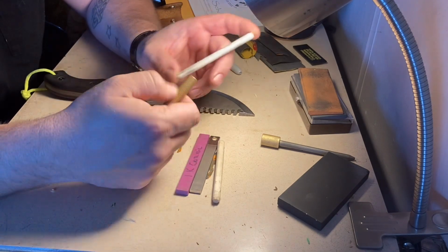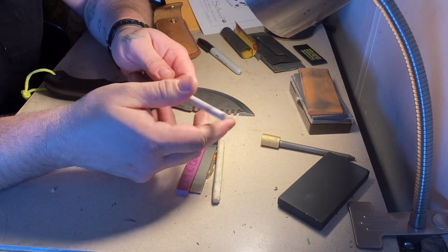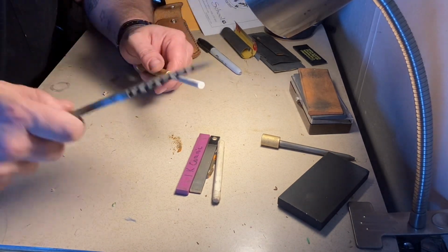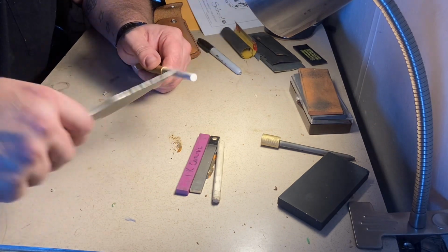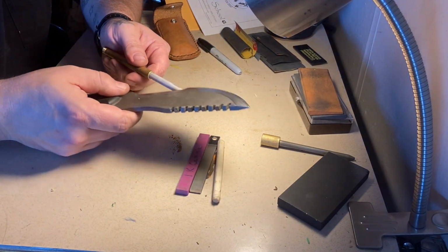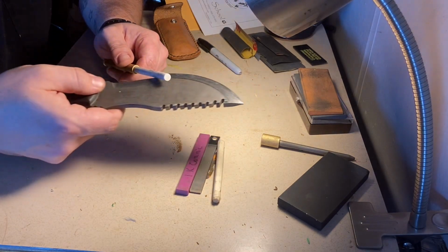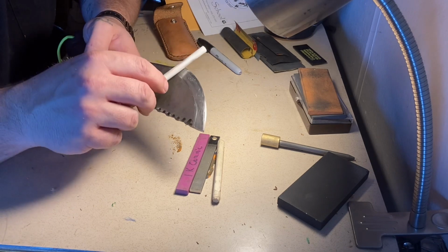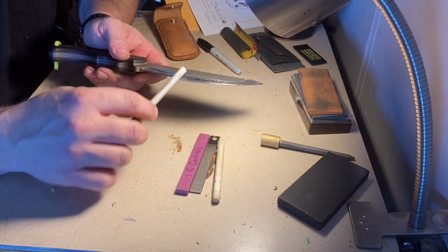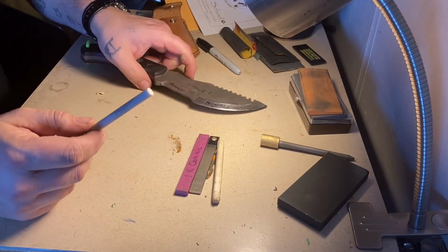If you have this, use your brass rod, you can actually slide this up inside, and it stays in there extremely well. I can pull it out, but you can shove it in there and it gets kind of stuck. Then you can use it again like a sharpening steel, like so. You can use it just to sharpen up an edge. Or you can use it the other way, where you're just freehanding it the opposite way, and you can work on that quarter rounder a little bit to get your fingers away from the edge. I like it better than the dog bone thing. And like I say, it's removable, so pop it back out.